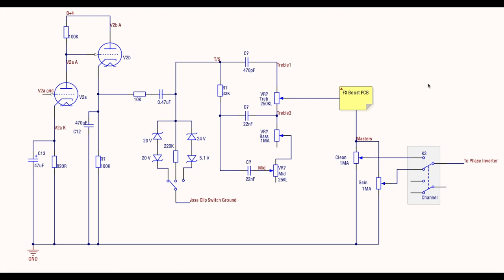Three things to talk about. First of all, this is the 10K resistor and the 0.47 microfarad. This is how we're setting up our Jose clipping circuit, right? What normally happens here, if you've followed my channel, you would have seen me talk about this in the 1987X mod video. Normally, your cathode follower here gets 100K to ground and your tone stack, TS here, connects directly to this point.